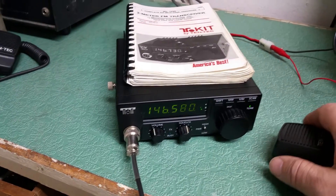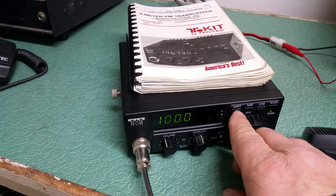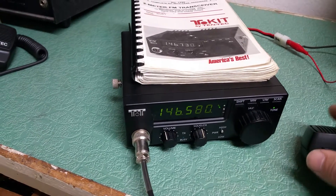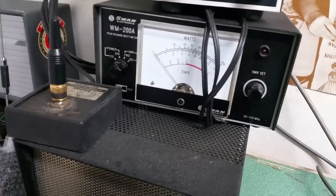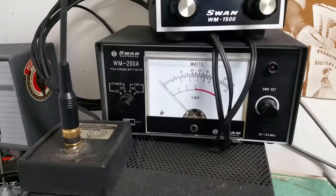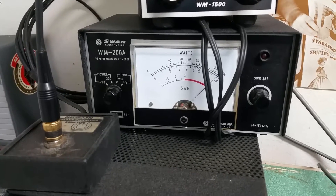Let's see — I've got on high power. Go to simplex here. That's the tone. There's simplex. We're going to go ahead and key it up. You can see the TX button there, and up above here — get the right meter going. There we have it. I apologize, I've got so many cords in the way, but I'm going to key it up here. You can see it does just about 20 watts output on high power.